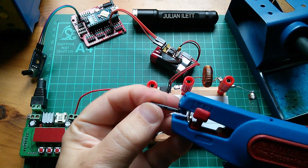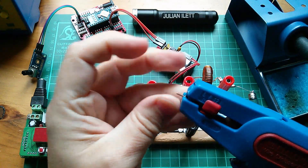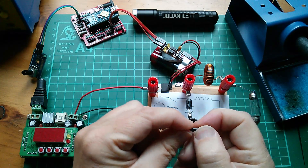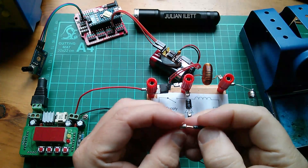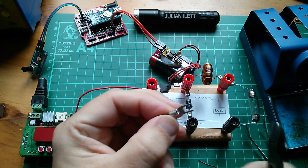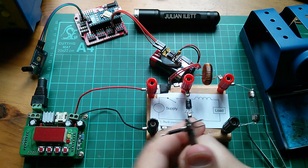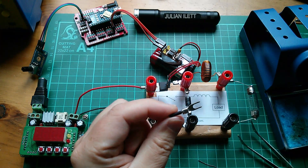So I've just cut a little piece of wire, just strip the two ends off. It's a little shorter than that one, but it doesn't really matter. None of these dimensions are particularly accurate, particularly that one in the top left hand corner. So I'll just crimp these spade terminals onto the end — I'll just use my cutters for this — just squeeze that down onto there, and then feed some solder from the right hand side and solder that on.